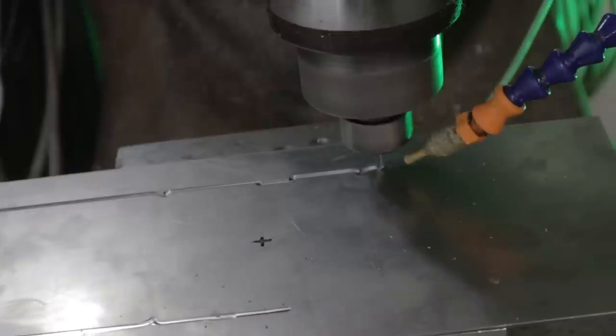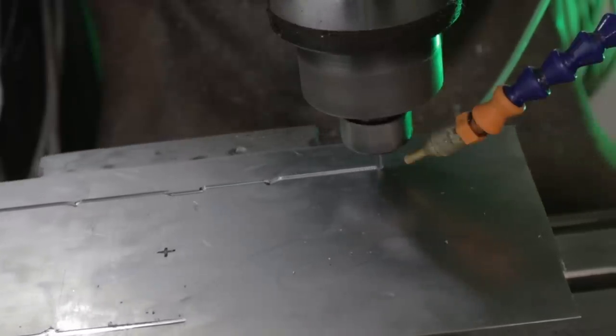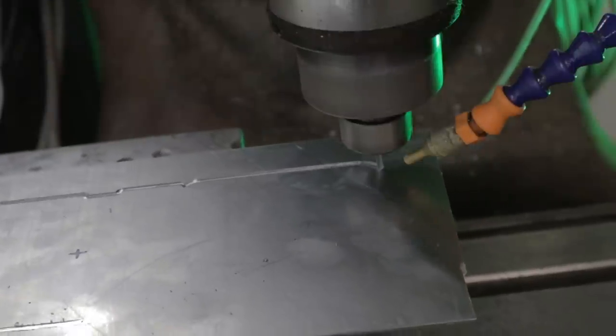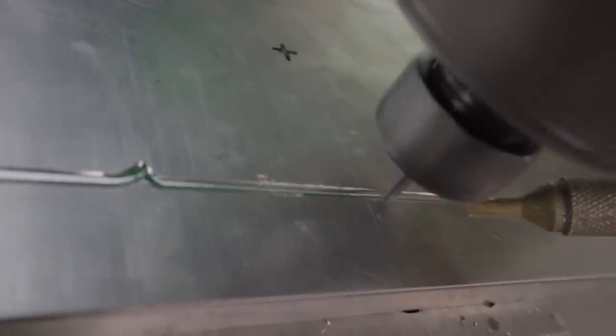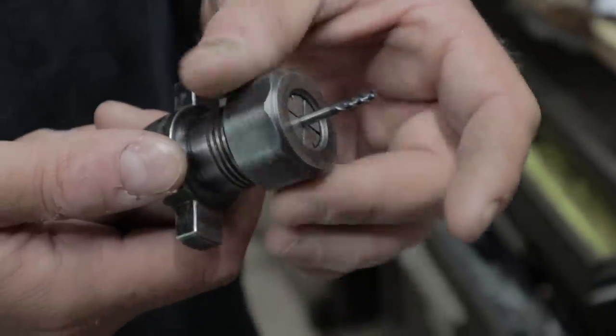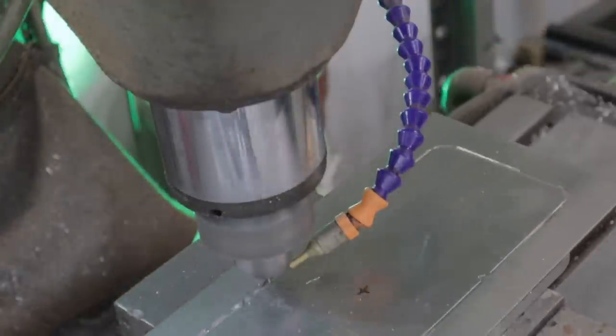One of the difficulties in machining titanium is that you have to use carbide cutters. Carbide is stronger, yet also more brittle, so you have to make sure you control your speeds when machining, or you're going to break a tooth on your cutter, and it could possibly ruin your project at any point, no matter how far along you are.